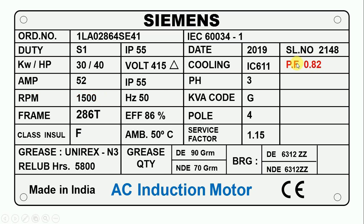After this, here it is written PF, which means power factor. As you know, a motor is an inductor, and whenever we connect power supply to an inductor, the power factor lags — that is, it goes backwards. For this motor, if we connect power supply, the power factor goes to 0.82, meaning the value of power factor becomes 0.82.